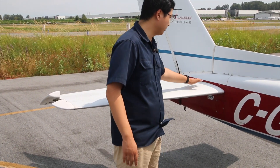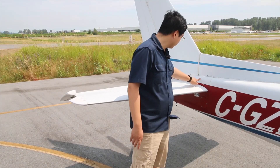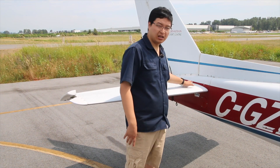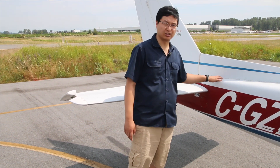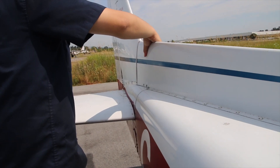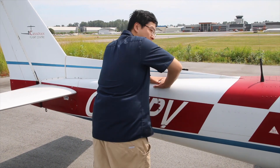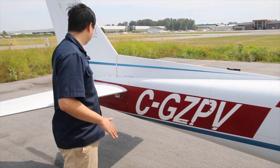It's not recommended to always use the elevator spar to take the full weight off the ground, because the elevator is attached through the bolt and fitting that goes through the fuselage — over time it damages that fitting. So it's recommended to use the fuselage itself as the primary push point for the aircraft. The forward rivet line on the fuselage is hard to apply force to because it's so close to the center of gravity — pushing the tail down from there is quite impractical.